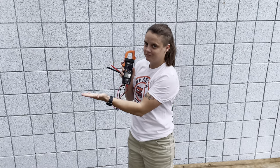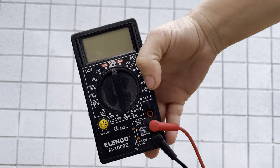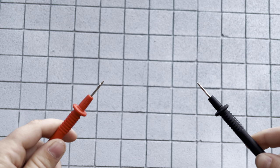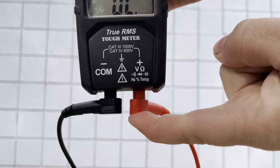Once you do get to the front of your furnace, now is when we pull out our multimeter. I use a Klein because I think it makes me look cool, but for this test you can use a cheap Harbor Freight multimeter if that's what you got. And if just the sight of this thing gives you PTSD from your high school physics class, do not worry — at the end of this video I'm going to give you a shortcut to potentially diagnose this problem using just your ears. For those of you living your best scientist life, you're going to set your meter to continuity — it's the symbol that looks like this. Then touch your probes together and you should hear a really annoying beeping noise. If you don't get a beep, make sure your probes are pushed in all the way and that you're set to the right setting. Continuity is going to tell you whether or not this switch is open or closed, or whether or not electricity can go through the switch.